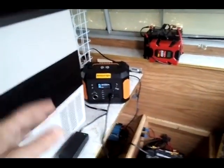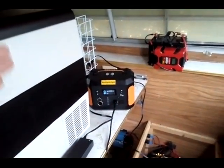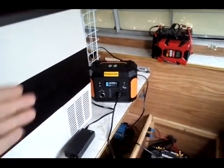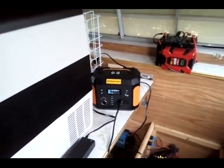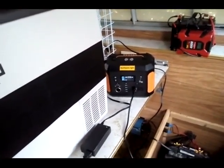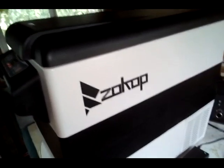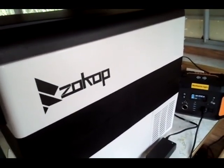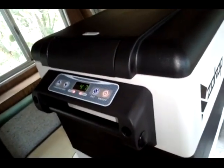You can find all kinds of units like this online for less than $200. This can run my chest freezer in the house — I'd say nine hours is cutting it close. At the 10-hour mark it was dead, it didn't charge correctly, and it didn't read correctly. So 10 hours pretty much destroyed it, and it finally started working correctly. I figure eight to nine hours on an indoor chest freezer, but it has to be already frozen.